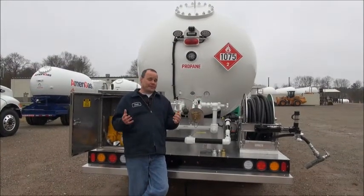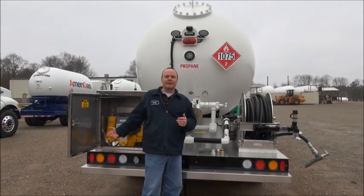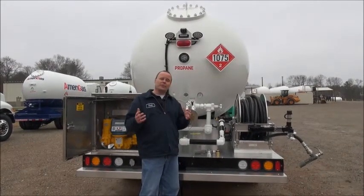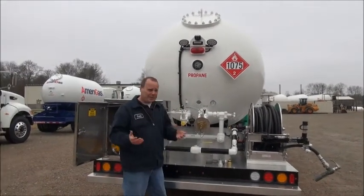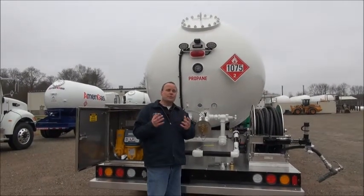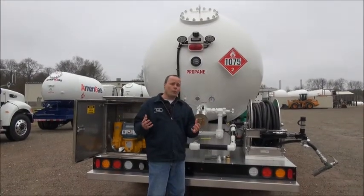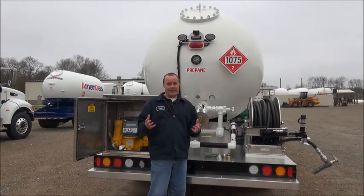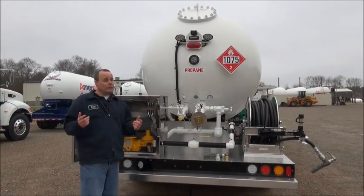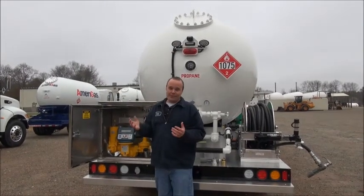The other issue: you've got 110 pounds of differential pressure but you're not seeing the gallons per minute that you want to see. There are a lot of possible causes, but let's touch on a few. One of them is the piping system — here at Lin's we pipe everything two inch, but a lot of other builders use smaller piping. Also the bypass: we've got a two inch bypass, but a lot of the time you're only seeing an inch and a quarter bypass, and that can affect the gallons per minute. Also you could have a meter issue. One of the most common ones we see is the strainer — it needs to be cleaned. If you haven't cleaned it in a while, that could definitely be your issue.